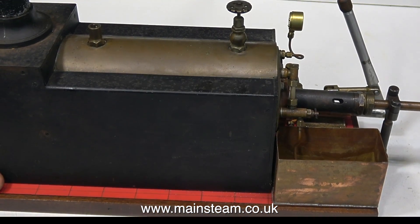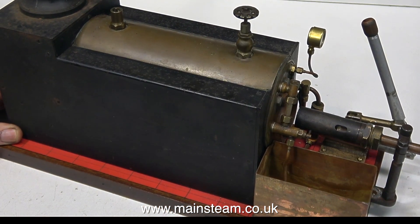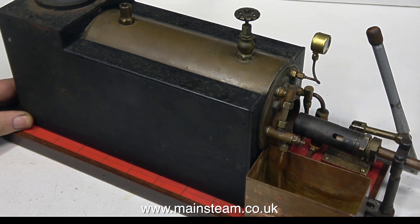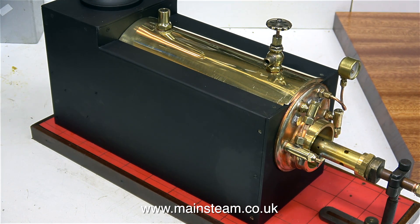By way of a comparison, here is the before — and as you can see it's fairly horrible. The brass wrapper was so tarnished I thought it was copper, and there was a fair bit of asbestos in the casing and around the boiler. But now it looks like this, and I think it's a bit of an improvement. I still have to do some work on the boiler — I need to paint the heads of the countersunk bolts that hold the back panel in place, and I need to fit a water system so I can pump water into the boiler. But that's it for this episode. Thanks for watching, and I hope you found it useful.